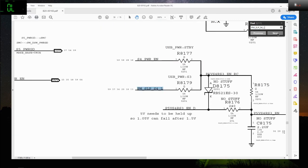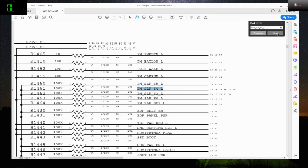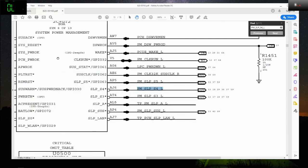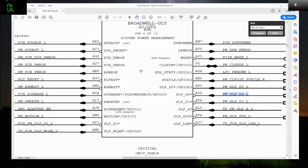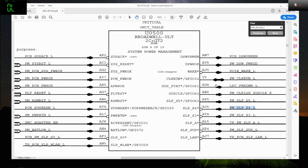So I looked this up again — where this rail is being created. I ended up at the CPU. So it's coming out from the CPU — so the CPU is 100% at fault? Well, the CPU itself is also a chip that if you don't actually have all the right signals coming in, it won't send out any of this.